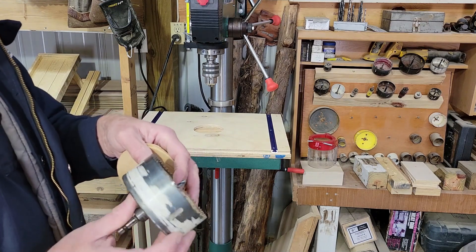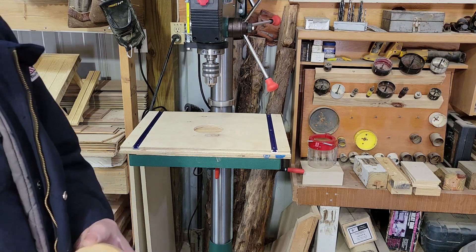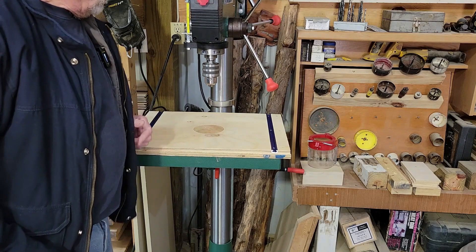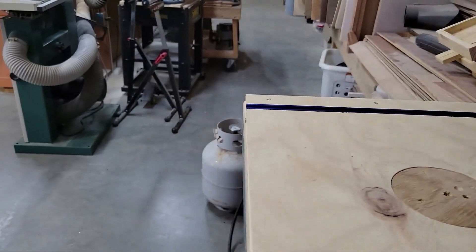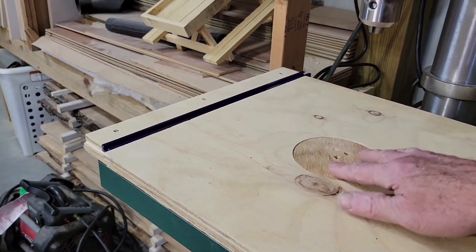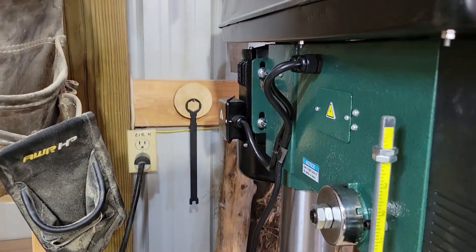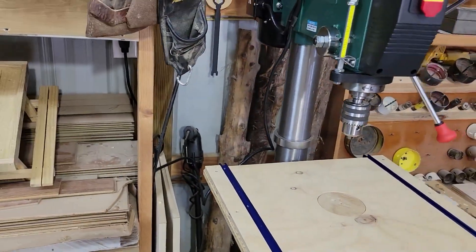The first hole was a straight four-inch hole, and then I came back with a four-and-an-eighth inch hole for the next piece — just one size difference, so this fits directly into that. As I bring the drill press down, it's offset just slightly from dead center. That way I can swap it around or move the whole piece in and out to hit a new spot when one area gets worn out. I can flip it over and use the other side, or throw in a new one — I cut two or three spares and set them on the bench, so that'll last a good long while.